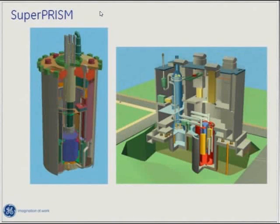So the GE engineers went back and put a dome on top of the reactor vessel — effectively a soup pot — to satisfy the NRC's containment requirement. But it wasn't as economical as they thought, so Chuck Boardman's team came up with a different design: a square box that shares space with the other reactor vessel via a rupture disk. If you have a sodium fire or overpressure event, pressure vents into the void space above the next reactor, decreasing pressure so you don't have to build as thick a containment while still protecting against worst-case accidents.